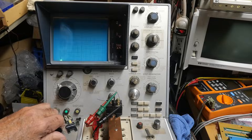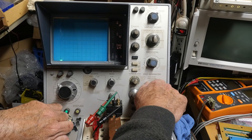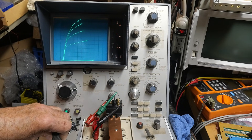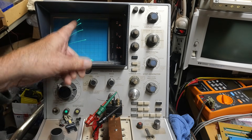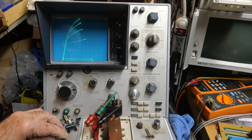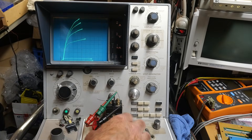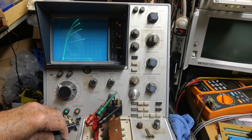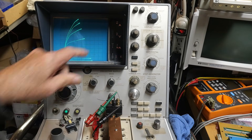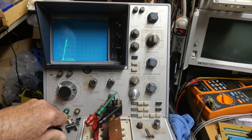Let's see if we can get a little more juice out of it. Going to 1 milliamp per step — that'll take us up to 20 amps, so the top of the screen is 20 amps. This part has lots to go: it's a 50 amp part and we're at 20 amps and it's acting very, very nicely. Hardly getting warm at all. Pretty nice part. Our beta is 2000 per step — very, very high gain, very high wattage.